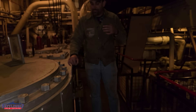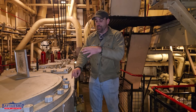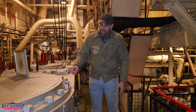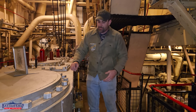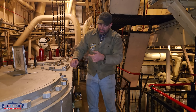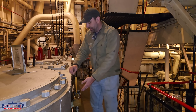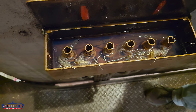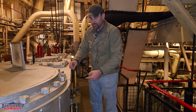Each piece of yarn will drip a certain amount of oil per minute. So if you have a machine like this — the low pressure end of the triple expansion steam engine, one of your most critical pieces of equipment — you're going to have several pieces of yarn on here so that you're getting several drips of lubrication per minute. And you can see that it is dripping off of here. Notice that these various wicks are all sitting in a bed of oil, so the oil is being wicked up by the ends and dripping down off of this end when it's in use.